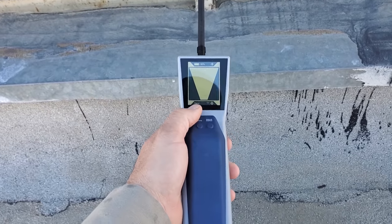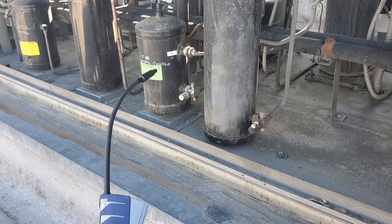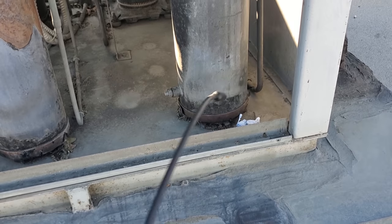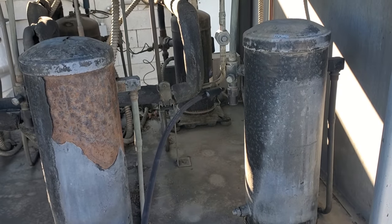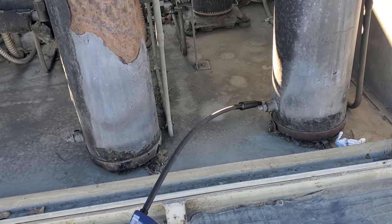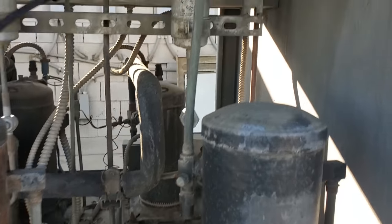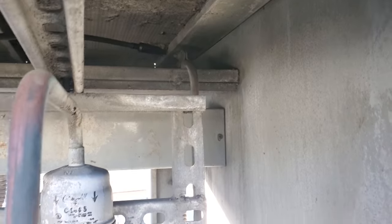I'm on super mode — not using cloud hunting or anything like that. I dig how this one has a battery indicator. So we're just going to start at the bottom of the receiver. These service valves are why I didn't want to put service gauges on — I wanted to see if maybe it was leaking at the caps. Once I check the caps, then I don't mind putting service gauges on. Check the high pressure relief blowout. Nothing down below. Going into some awkward spots up on top of here — there's a lot of dirt, so got to be careful. Going to leak check the bottom of the condenser real quick.